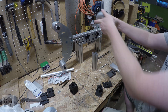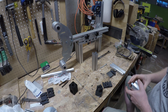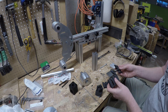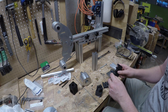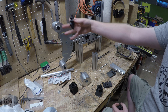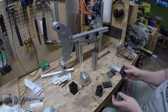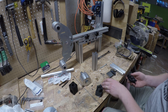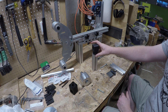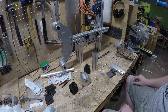The tensioning wheel needs to tilt up and down to allow you to track and keep everything centered, and that needs to be mounted on a hinge. I was going to 3D print one and did a couple of iterations using carbon fiber reinforced PLA, however when I put the bolt in, the joints would break. I can't make it much thicker because then the wheel would track out too far versus the working wheels. So unfortunately the 3D printed carbon fiber reinforced PLA solution is not going to work. There is some material in this piece we could use to slide in and mount the arm — hopefully it has enough cross-section to be strong enough. That might be something I'll have to replace with metal in the future.